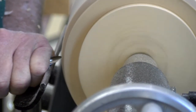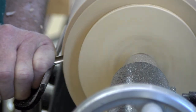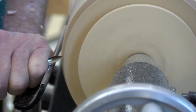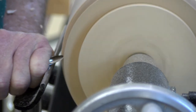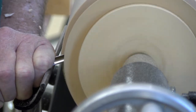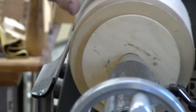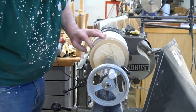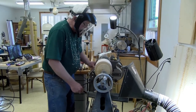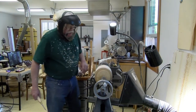I don't have to go all the way in. You can hear it bouncing — that means there's still a rough surface. I can go most of the way in because I'm going to cut a little rabbet on the inside anyway. That's all there is to it — it's got a nice clean end grain cut. I'm going to do the same thing to the back side, except I'm going to add a little bit.